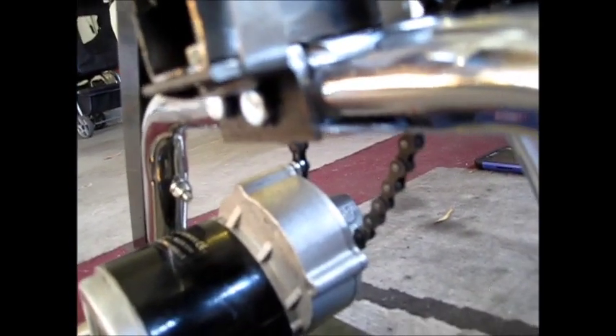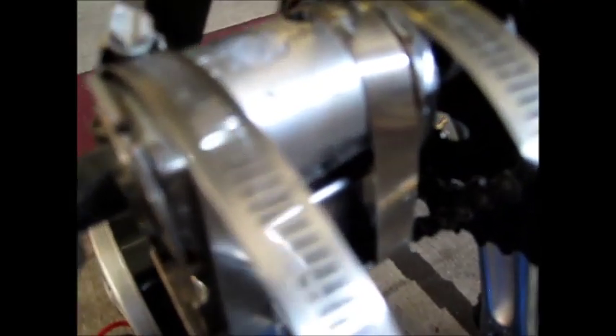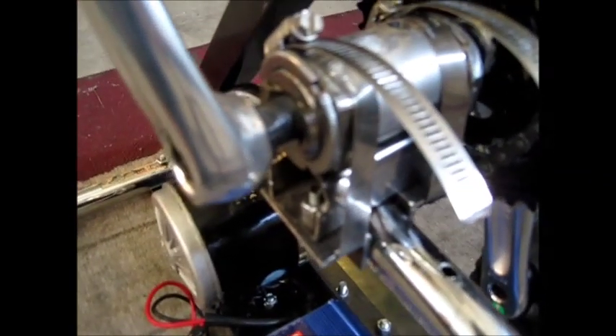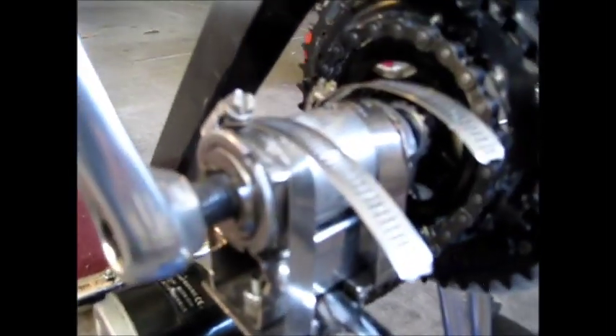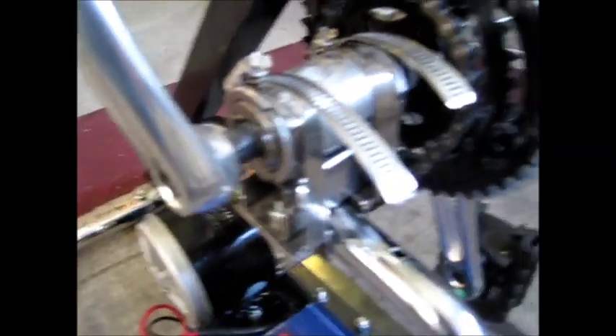It's connected to the pedal exerciser using square tubing on the bottom with angle iron. The square tubing is connected to that, and the bottom bracket is connected to the base also by a bolt. I have one bolt that goes into the bottom bracket and another that also goes into the square tubing, and I put hose clamps on just to make sure it's extra secure. Everything here is attached metal and tightened down well — I haven't had any problems with shifting, and I was able to mount all that without any welding.